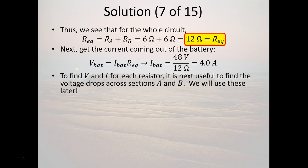That 4 amps proves quite useful because even though we don't know the currents through individual resistors, we know the net current through part A is 4 amps — during any given second, 4 coulombs of charge pass into and out of A. Using that, we can find the voltage drop across A: A has an equivalent resistance of 6 ohms with 4 amps going through it, so the voltage drop across A is 4 × 6 = 24 volts.